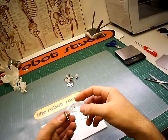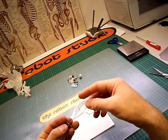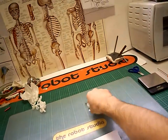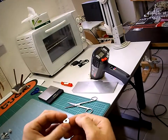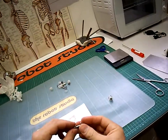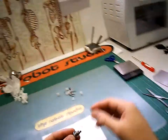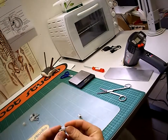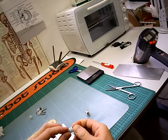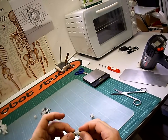And so the hot side goes on first, and just wrap it round, press it down, pull it tight. Take a washer — the washer has two sides, it has a sharp edge and it has a blunt edge. So it goes in like that, over the top of it. And you just pinch it on those fingers like that, push it forwards a bit, and just make a little cone.